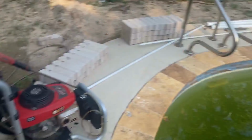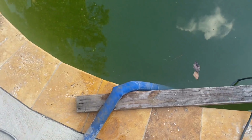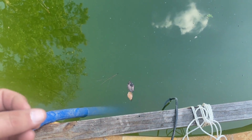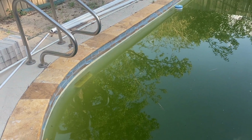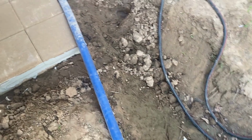And so the mortar on this stuff actually set up a lot quicker than I thought it would. Went ahead and went to the United Rentals down the road, got the submersible wet pump for this thing, tied it off to the board here, and suspended it up off the bottom of the pool a little bit so it wouldn't mess up any of the plaster. But got it going again. It's been on for about a minute. We're already about 2 inches down on the water line, so this thing's rated for pretty good GPM on the flow. But basically just got it routed around here.